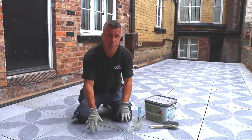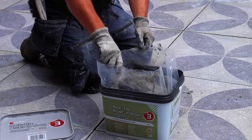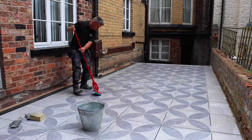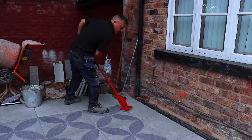Because these slabs were laid onto the rock-tight mortar directly onto the hardcore, I'm going to be using a rock-tight brush-in grout. Now this is quick and easy to apply. All we need to do is wet our surface, scoop out some of the grout, drop it into the gaps, and then use quite a rigid brush to brush it in and then simply wipe it off.